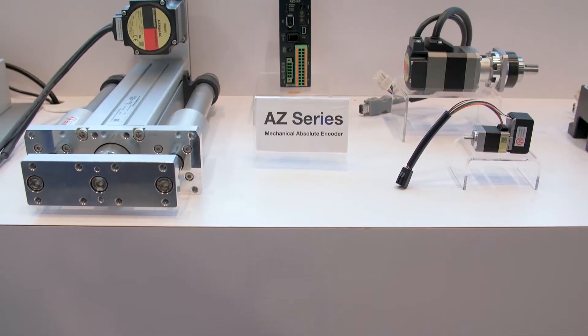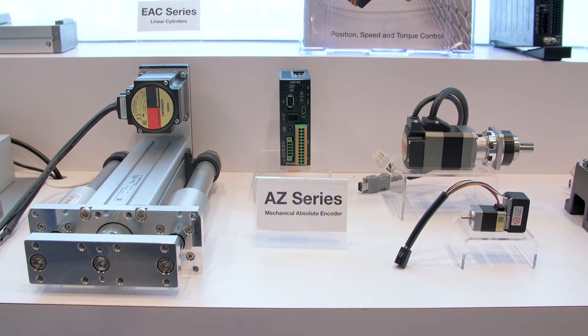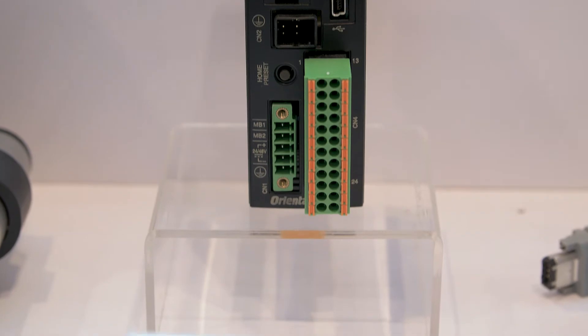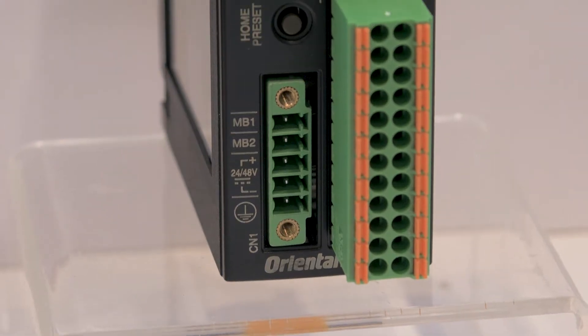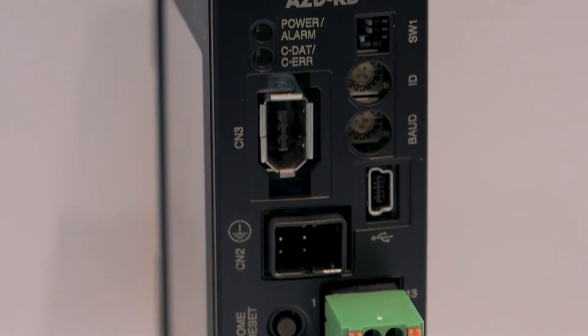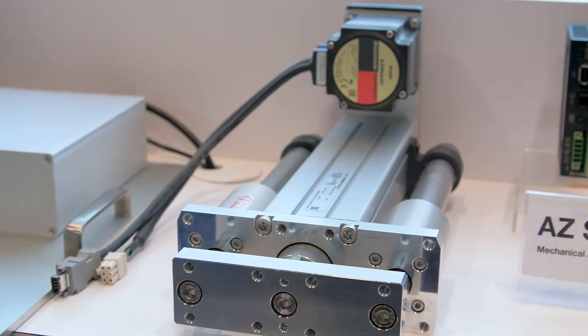So it sounds like we want to talk about the Alpha Step hybrid control system. What's that all about, and why is it applicable to the packaging industry? So our Alpha Step hybrid control system combines the best of both worlds — it's a servo stepper hybrid motor. It gives you the best of the open loop performance, the quick snapping movements that a stepper motor can supply, but also that closed loop control and reliability that is particular to servo motors.